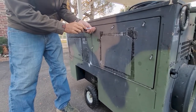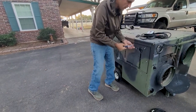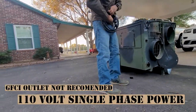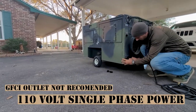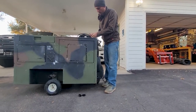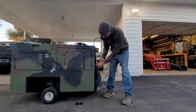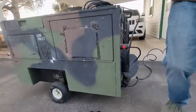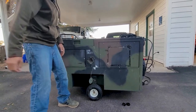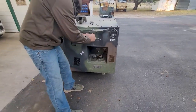So then you can close this back up. These panels, in order for this to run properly, do all need to be closed because there's a safety switch that will not allow the burner to fire if they're not all closed. Then I'll plug in my thermostat as well. The next step: you have to make sure this little cover comes off because this is where it sucks in clean air for the burner.